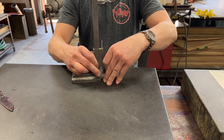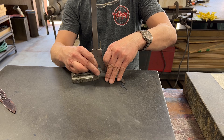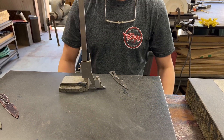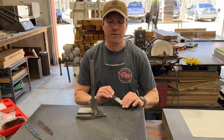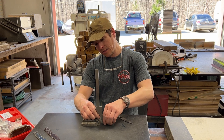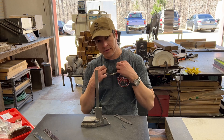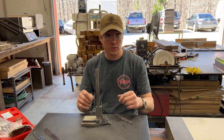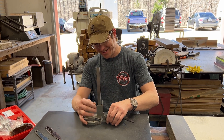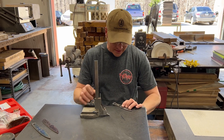I got 96, then 98, then 98 — so I always go with the reading I get multiple times. As soon as I get a multiple reading, that's my number. Half of 98 is 49, so I'm gonna set it to 49 thousandths. Got my glasses — Peter Kohler says I look old, but I got them for you, Peter. All right, so I put it at 49 thousandths.